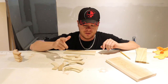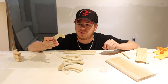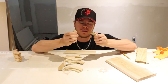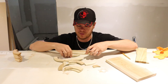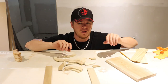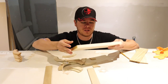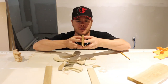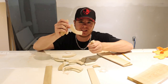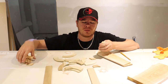I had a dilemma to fix. Initially I glued two pieces of quarter-inch thick poplar together to make the little flower pieces, but they gave me a really thin glue joint I couldn't clamp well, and a lot of the pieces were brittle — several already broke. So I had to reevaluate. New game plan: I took some three-quarter inch cedar scrap pieces that were cut off and had them re-sawn down to two quarter-inch pieces, then recut all the pieces from a single piece of solid stock cedar and routered all my edges over. Sometimes not everything goes to plan — you just have to rethink it, but there's always a way around it.